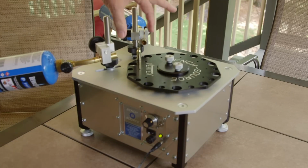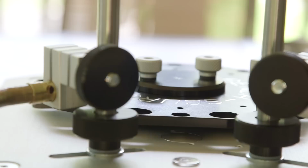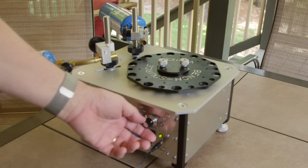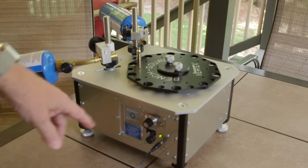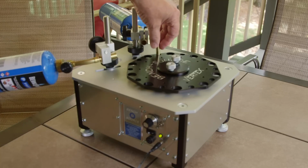When it gets here inside the torch, it rotates. So watch that one again. That's where it's going to rotate inside the flame. Now the amount of time that it spends there is determined by this little dial. I had it on 1.5 seconds. Now let's put it on 3.5. 3.5 seconds in the flame, which would probably burn that one up, but that's all right.